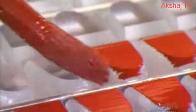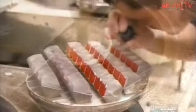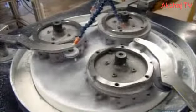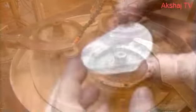Protective paint prevents any dust from contaminating the pristine surface. Grinding with diamond dust removes mere tenths of a millimeter of glass. Polishing with an even finer abrasive removes another one one-hundredth of a millimeter. At the end of it all, the three sides are perfectly flat, which minimizes reflection — critical for making the glass see-through.